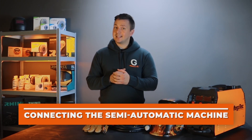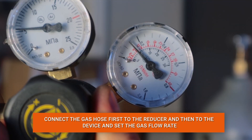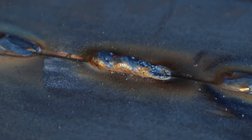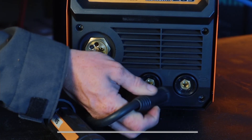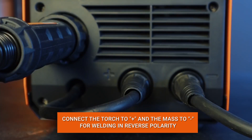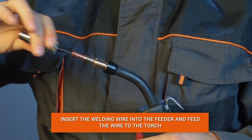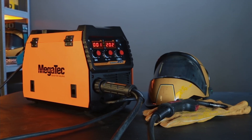It's time to plug in the device. Attach a gas hose to the gas reducer, then connect the gas hose to the apparatus. Set the gas flow rate at the reducer. Gas consumption directly affects the quality of the weld — if there is not enough gas, pores may appear on the seam; if there is more than enough gas, swells occur and the welding arc may deviate. Connect the torch to the plus euro connector and the mass to minus — we will weld in reverse polarity. Next, install the welding wire in the wire feeder. Be sure to remove the nozzle and the tip, cut the excess wire, and leave 5–10 mm. The device is now ready for use.